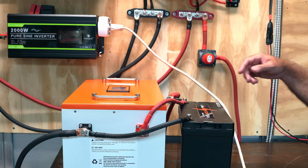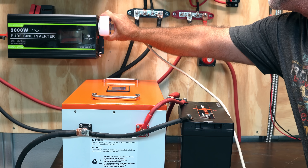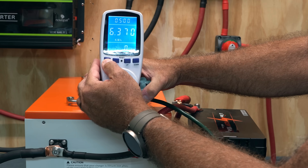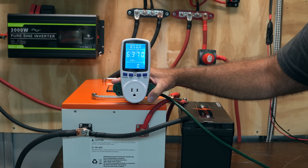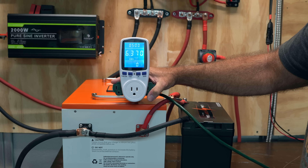It has clearly shut down and the inverter has its low voltage alarm. The display on the large battery shows zero percent, and there is no display on the smaller battery. Let me check the watt meter — 6,370 watt hours. We calculated our estimate at about 6,400 watt hours, so we pretty much nailed it — only 30 watt hours shy.